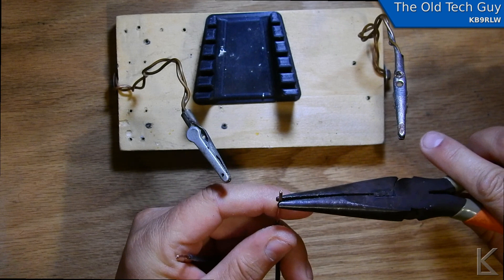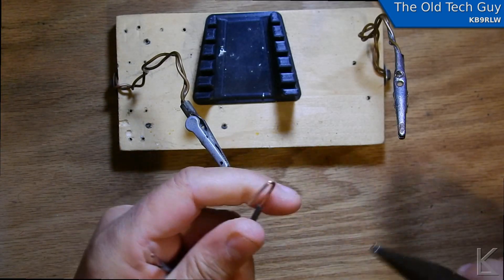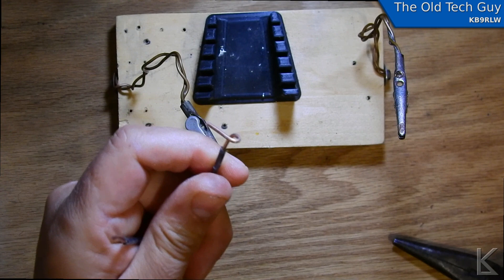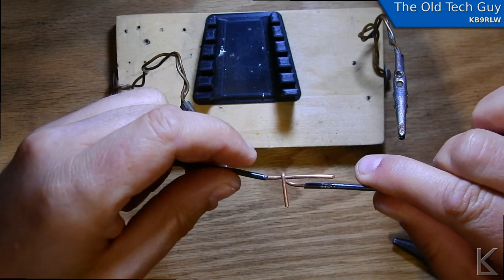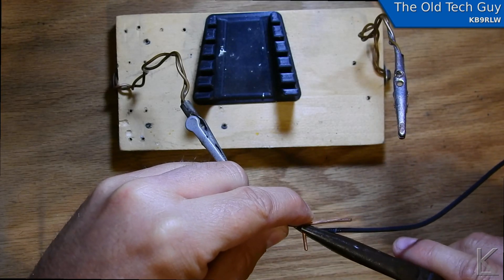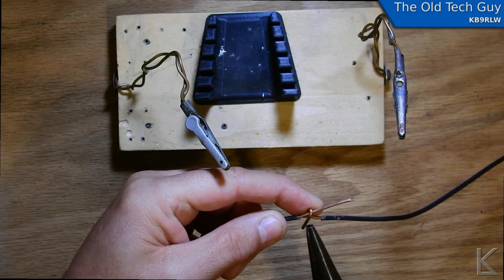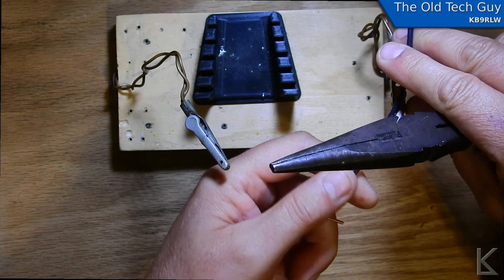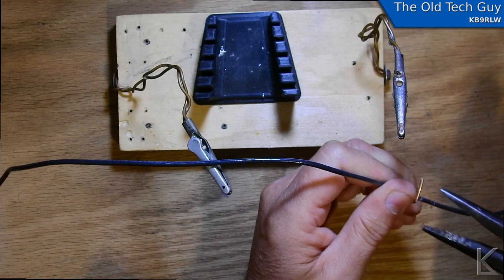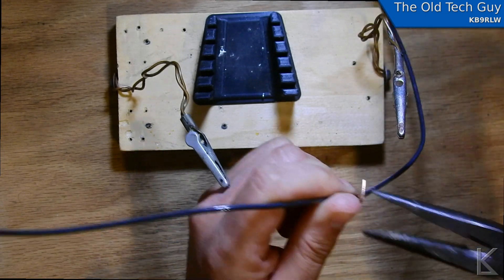It is definitely a strong splice, and the way that I do it — especially on heavier gauge wire — I'll use pliers. I'll put a bend in the wire, like so, and then I'll take that bend and give it a bit of an angle, like so. Then you put this onto the other wire like that, and I will crimp that down to hold it. I'll take the pliers and wrap that little end around. This is going to be really hard to do and stay in frame on camera, but hopefully you'll get the idea.